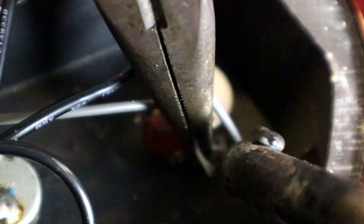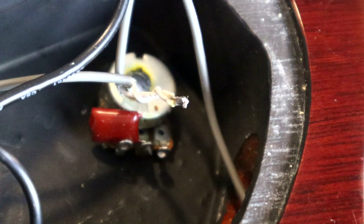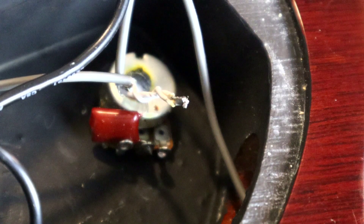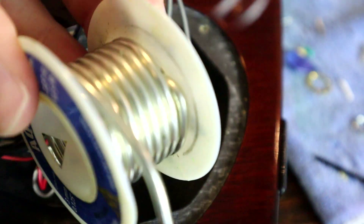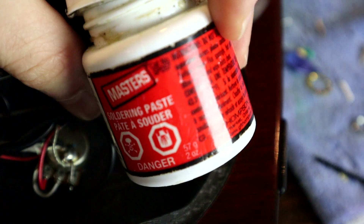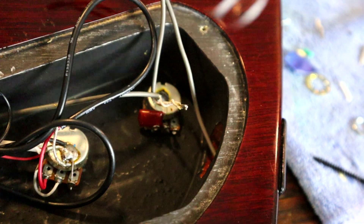What you're going to do is desolder the two hot wires from the tab and then put them into their own connection. You want to have ample airflow and make sure the soldering iron is hot enough to melt the existing solder that holds the wires together. Just like that — as you can see, I've twisted the two hot wires and they are still soldered together. Make sure you're using enough solder and a little bit of soldering paste to ensure the connections are clean and will stick.